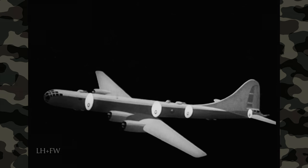Now you're about set to take off. After you're cleared, turn the plane the rest of the way around so that it points down the runway, then stop again while the co-pilot lowers the wing flaps about 25 degrees. He can tell when they're right by looking at the wing flap position indicator, and the gunners can check on the accuracy of the indicator by watching the flaps from their blisters. They report the approximate flap position over the interphone. When the co-pilot tells you the flaps are okay, fasten your safety belt and set the manifold pressure selector to position 8. Set the propeller RPM switches to increase RPM and wait for the lights on the co-pilot's instrument panel to flash.